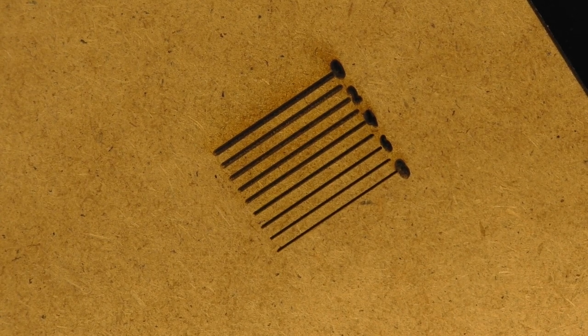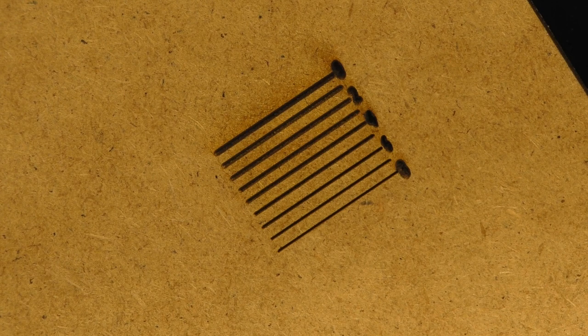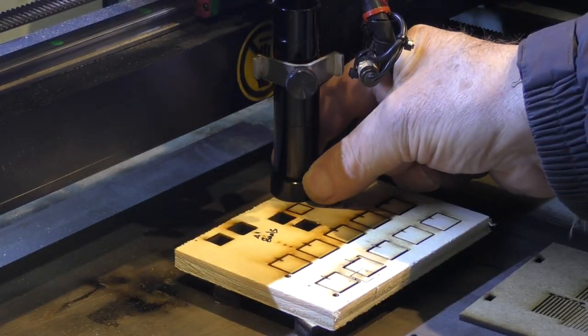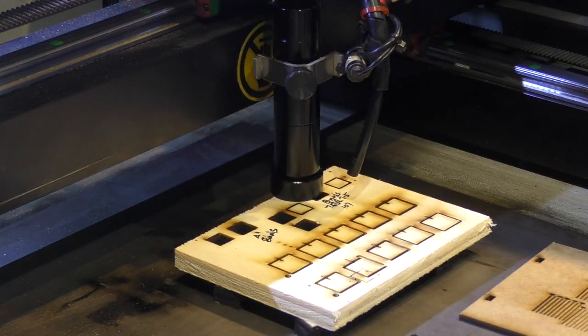The focus test shows we're heading in the right direction. The real focus is getting close to about 8 millimeters, so I should drop that down by another three or four millimeters and start the whole process again. That is looking pretty good — probably the best might be somewhere around four or five, but look how thin all the lines are for about six or seven millimeters. That means we have a very wide focal range, which is good news. We're going to set the focal distance to 38 millimeters — setting that by putting the gauge down on the work and dropping the table down 38 millimeters in Z.